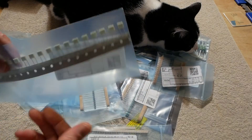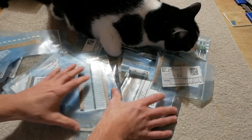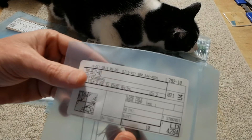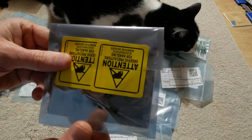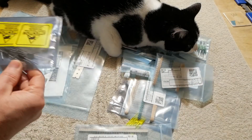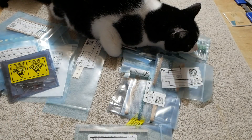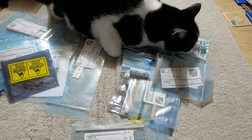I want to get the proper size. Film capacitors will be used in multiple positions in the amplifier, including some larger size ones. These are fast recovery diodes I'm going to use across the output stage. They're called catch diodes — so if you're driving an inductive load and you have a relay or something that opens, you can get inductive kickback which produces a high voltage across the output transistors and could damage them. So I want those on the amplifier as a form of protection.